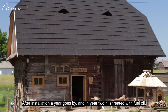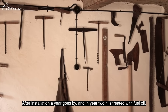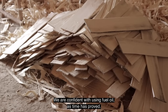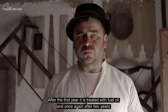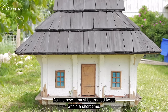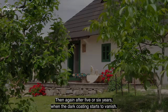After installation, we leave it for one year without any treatment — the wood stays natural. After the first year, having passed through all seasons, we apply tar (păcură). Time has proven this works. We apply it once after the first year, then again at two years. Being a new shingle it needs two applications fairly quickly, then at 5–6 years when it starts to lighten a bit and the dark fades, the wood shows again.